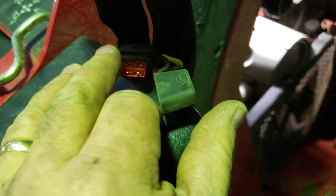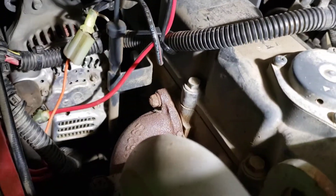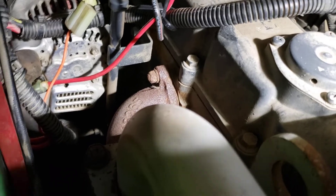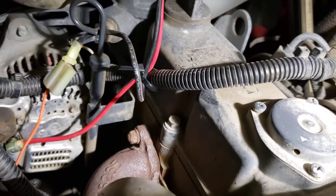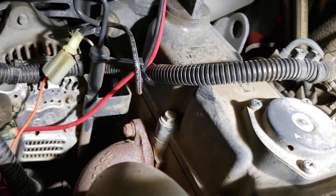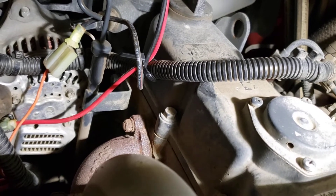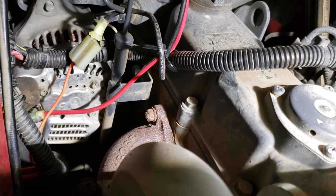So we got a fuse and I basically connected a wire which goes down to the alternator, which comes over to here. I put the red spade on the back of the alternator and the orange wire is connecting up to the black wire now. Connecting them together will allow you to see if the fuse blows going down to the alternator — right now I've got a 10 amp in there.